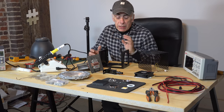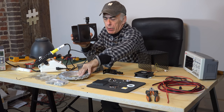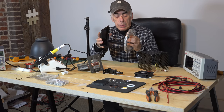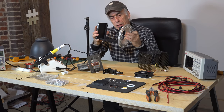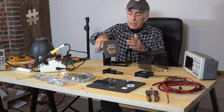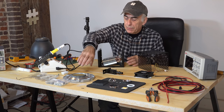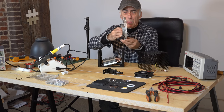When I did initially the enclosure in part number two there was a bit of a problem, as you might remember, when we were mounting the ring from our softbox. This ring is typically the ring from a Broncolor mount, but you could have another one. When we stuck it in you could see we had play on it. To fix that I had to create a back plate, and it goes in like so. I have spacers that I put in between in such a way that the keys here are caught, so I don't have the play anymore.